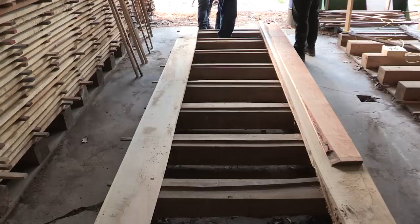The other thing about air dried lumber is once it's air dried, it's pretty hard to hurt it in a kiln — you don't have to be so careful with it. You put green oak in a kiln and you better be right on the spot, and you better not have any variation in that kiln or you're going to ruin it.